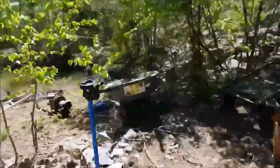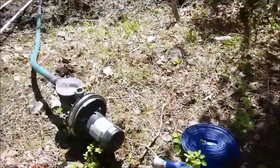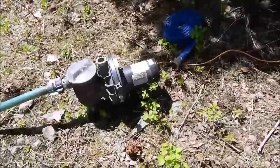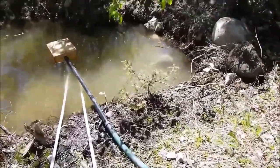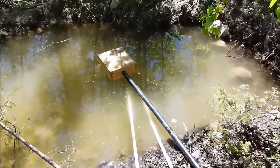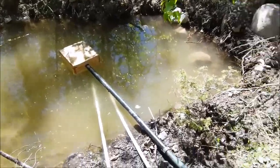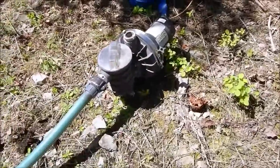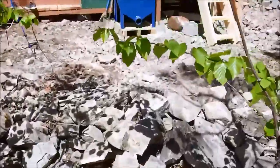I've just been down here working on getting this old hot tub pump — or pool pump or something like that — all plumbed in. We've created a special floating pickup down here that screens out anything less than a sixteenth of an inch, the screen that's underneath there, because you don't want garbage going into the Icon. There's another filter on the pump, and then there's also a filter on the Icon itself.